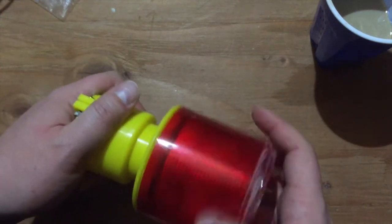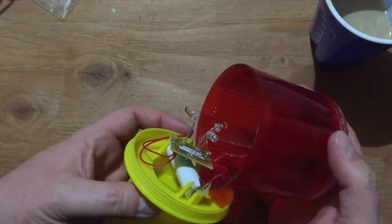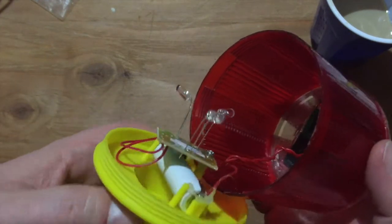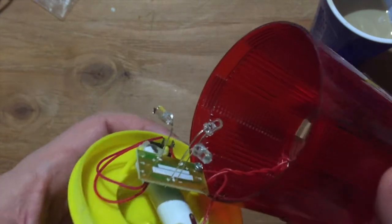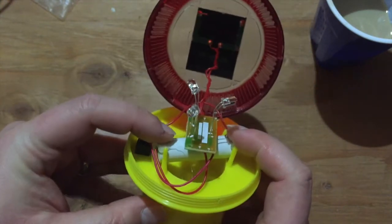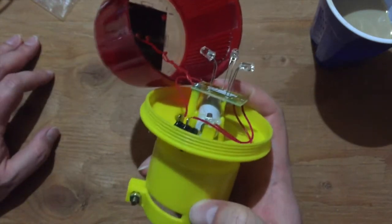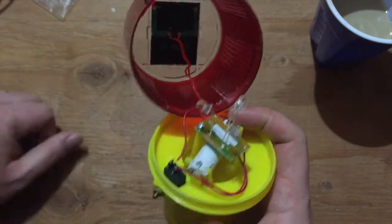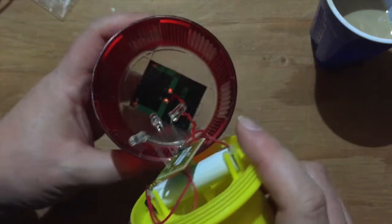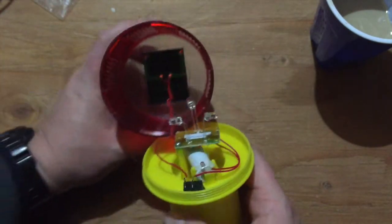It looks like it has screws — yeah, maybe not super waterproof. There's not a lot of slack there. So, three LEDs, just kind of bent outward. One battery, which looks like it wouldn't be lithium — it's probably a nickel metal hydride. I hope it wouldn't be NiCAD because the memory effect seems like it would be bad for something that's charging and discharging every day. I don't see any label, and I'm not sure if there's really any way to tell because the voltages should be about 1.2 volts either way.